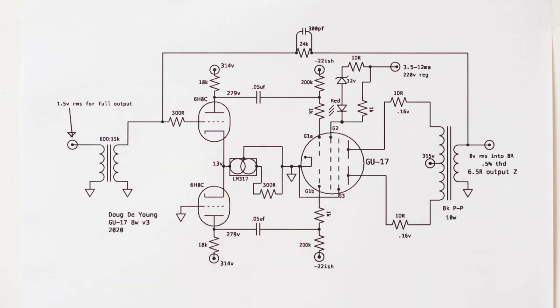1K is pretty typical, right? So I just sort of guessed. With stopper values, you just put them in. If you get oscillation, they're not high enough, and with 1K I haven't had a problem with that on power tubes. It's a pretty typical value. You can see that the suppressor grid, or the beam-forming plate in this case, is just tied, I think internally, to the cathode.